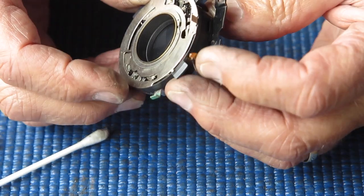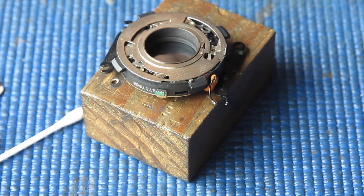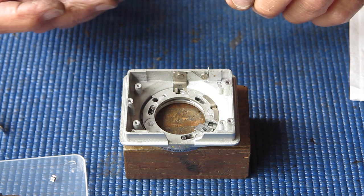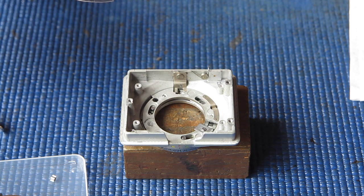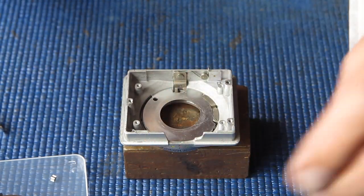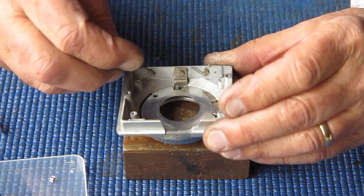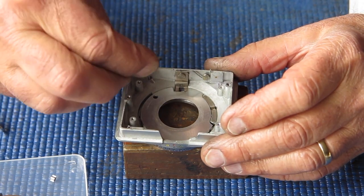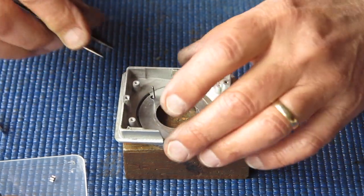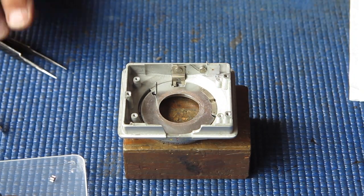Oh, that still sounds slow. I'll work on that. Well, I can put the shutter back into the mount now, I think. So I'm just making sure I've got everything ready. This baffle goes in here first. And our rangefinder coupling. Making sure that dropped through smoothly. It did.